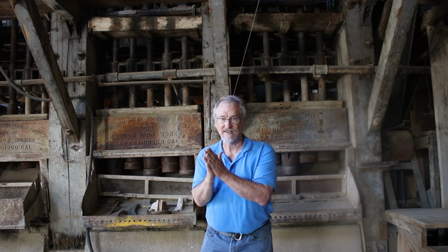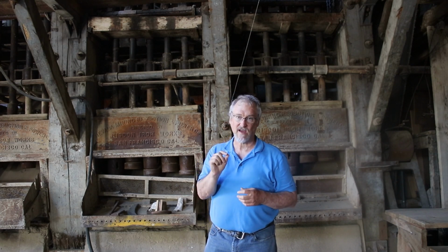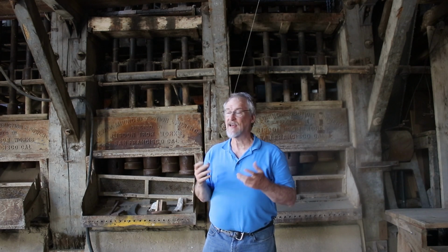and small to sand. There are some chain mills and hammer mills that you can put bigger rocks in, but it takes forever to beat them down from bigger sizes down to sand. That's why when I crush my own rock, I have a little jaw crusher. I've shown you pictures of it before, but here's what it looks like.